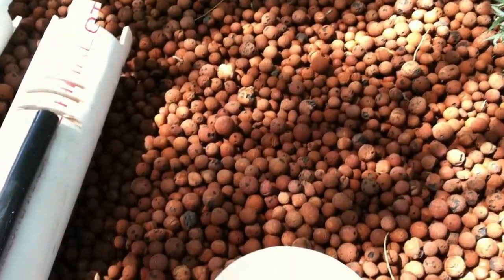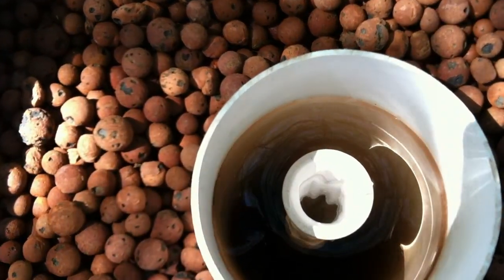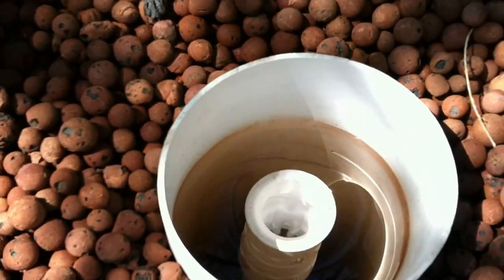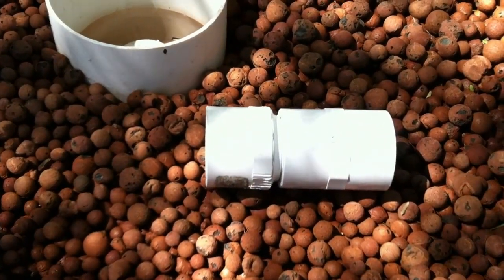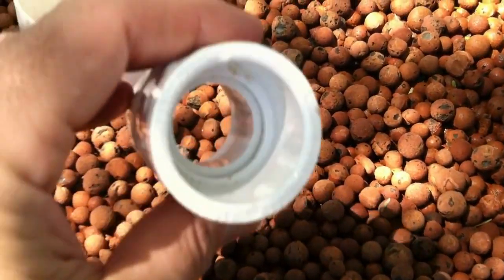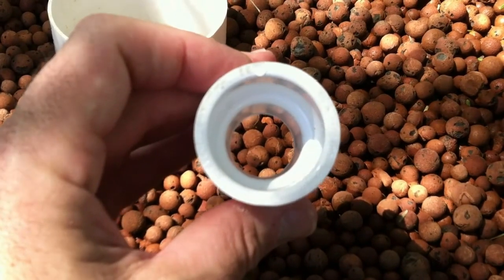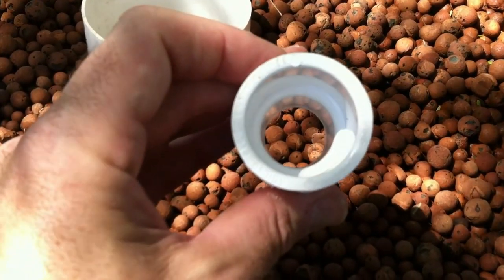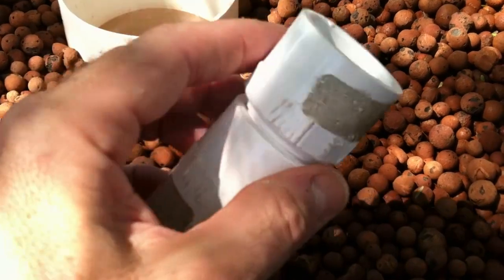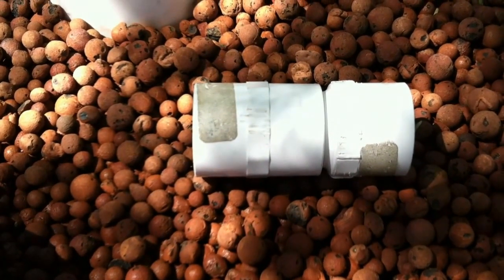My standpipe has a little extra fitting over the top. The water flowing over the top of that is creating a venturi system, which accelerates the water as it goes down the standpipe. I achieved that using a piece made of two parts threaded together — one piece goes over the standpipe, and the other has a nice smooth edge on the inside. What that does is the water goes in, reduces, accelerates, and starts pulling more water in with it. It's called a venturi system. You have to account for the overall height with this piece in, so you have to cut your standpipe accordingly.